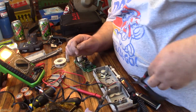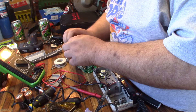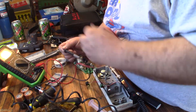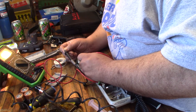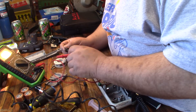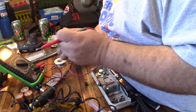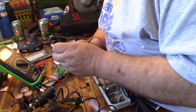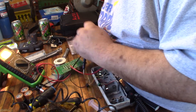Now what I'll do is just verify that this isn't shorted or anything. My multimeter leads are set for continuity. I'm going to check — this third pin right here is ground. It's also wired in common with the speaker ground, I think. Or maybe not. That ground is coming through there. Make sure we're not jumped onto that other resistor there — although that could be a ground side for that resistor. It's not. It looks like we're good.